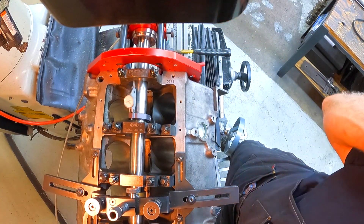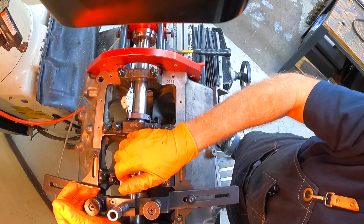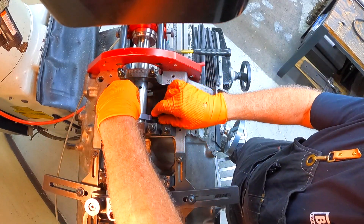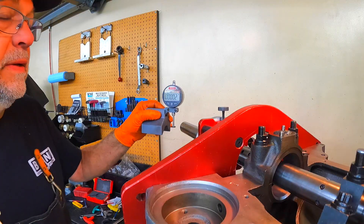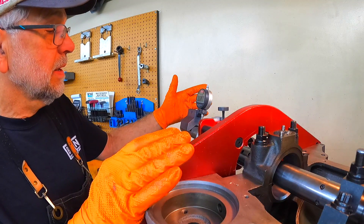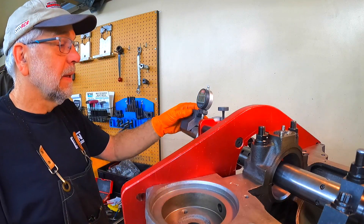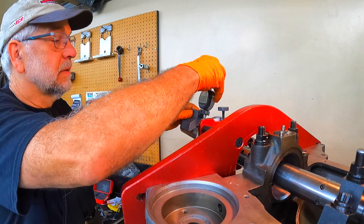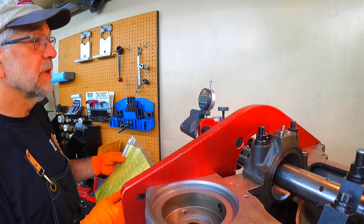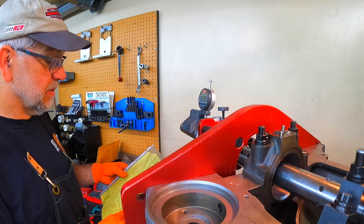That is how it's indicated in, and the bar is still nice and free, so you can snug that up and we're ready to start doing some cutting. I've got the little indicator here — magnetic — plants to the bar by magnetic. And that's how you set up the cutter. That would be a cheat sheet I made with all the sizes for the different style blocks. It works out pretty well — I don't have to guess at some of the sizes.